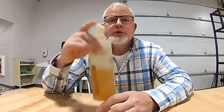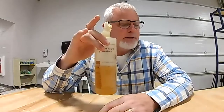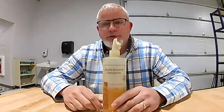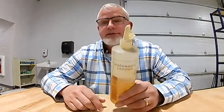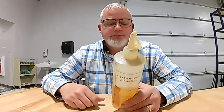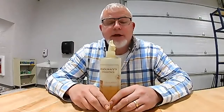And so walnut oil gives a really nice appearance. Okay. And I've found it makes just a really good kind of flat finish that protects the wood. I like this stuff. It's a little pricey, but it's nice stuff. It's non-toxic, obviously. It's all natural. So this is a good choice. A lot of people use a mineral oil, which is sold as a laxative. And the nice thing about that is I can get that at any store.